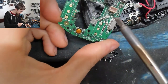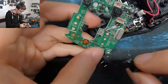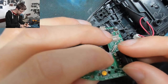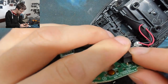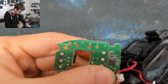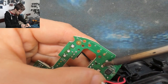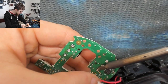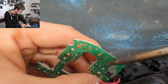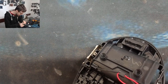I think I'm just making a bit of a hash of this, but whatever — it's Saturday and I'm fixing a grotty old mouse for myself. The board actually marks which way around the buttons go, which is nice of them. I'm going to put this switch on there, and because I didn't clear those holes I have to hold it in place and reheat from the other side. This is why it's nicer when you can clear holes.